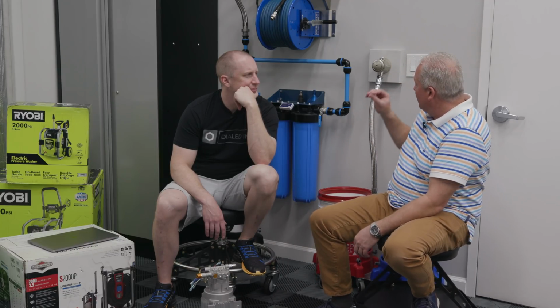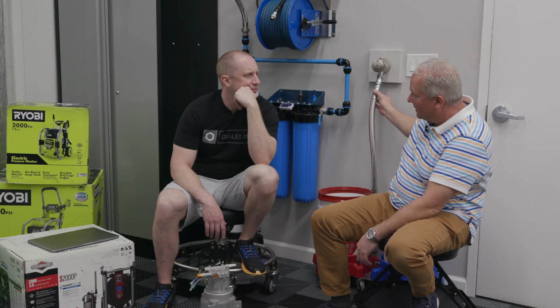I mean, we didn't get into all the specifics, right? But it goes into very fine detail that you have to have between 40 and 80 psi of water pressure. So you can't crank up to 100 pressure and try to force some more pressure, right? It has to be at an ambient temperature, off the top of my head, maybe between 50 and 70-something degrees. So it tells you what temperature it has to be at. Especially for a gas unit, to your point, a car engine or any engine is greatly affected by the temperature and the humidity that day. So all of those things are factored in when you're doing the testing.